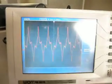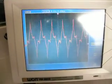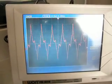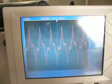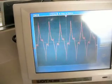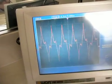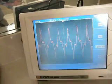So we're now in the water and this is what we get. So that's 60 Hz AC. So it's quite different. And each of the divisions on the oscilloscope is 200 millivolts AC. So we're currently at 6 divisions peak to peak, and that gives us 1.2 volts AC.